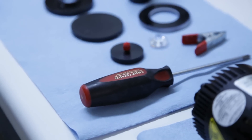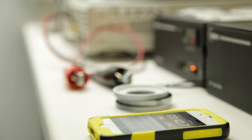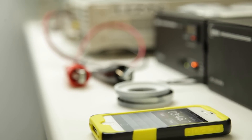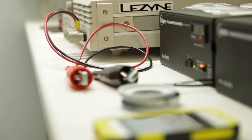There are tons of great reasons to use an integrating sphere. One is that it measures all of your light output, as opposed to a lux meter, which measures just one point of the beam pattern. So depending on where you are in the beam pattern, you might be getting hot spots or dark spots, and it doesn't really tell you much about the total light output. Another great advantage of the integrating sphere is you can measure lumen output over time, so you can see if your light output fades over time.